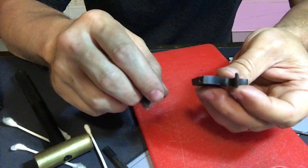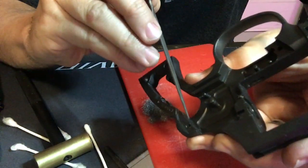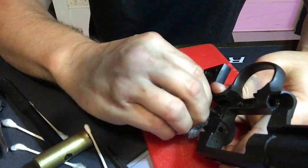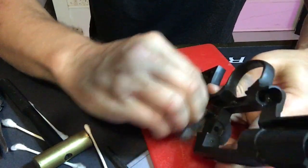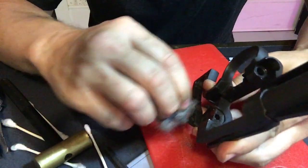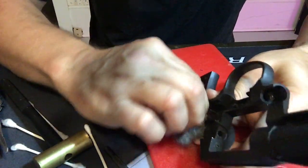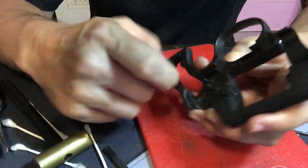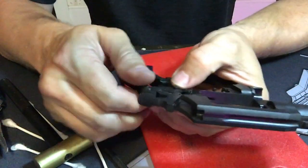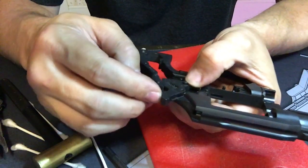I haven't seen many videos where people go into this amount of detail — I applaud you for sticking with me if you're here this far into the video. But this kind of stuff is what anybody can do to their own firearms at home if they're just brave enough. You can see the differences — it looks like it's been shot a lot; that's the whole point. Let's get those fine edges worn off where it operates a lot smoother. I'm going to clean out any steel wool particles that are stuck in here and give it a good washing. As one part gets fixed, we have to look at where it typically would wear. It looks like this rides a little bit on the back of the frame right here — it's rubbing. Polish that just a little bit. Parkerization is a coating — we want to make it as smooth as we can here without actually taking it off. That feels better — it's actually kind of shiny now. That's shiny just with a little bit of steel wool.